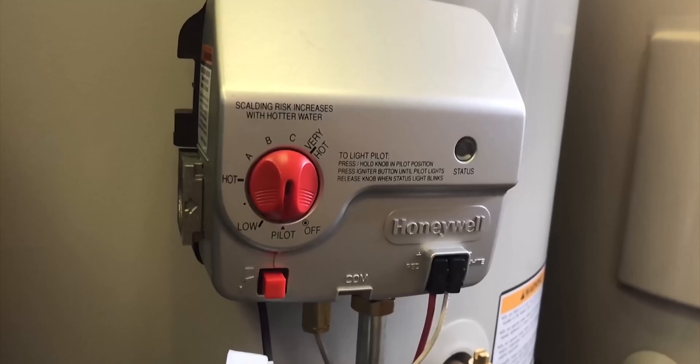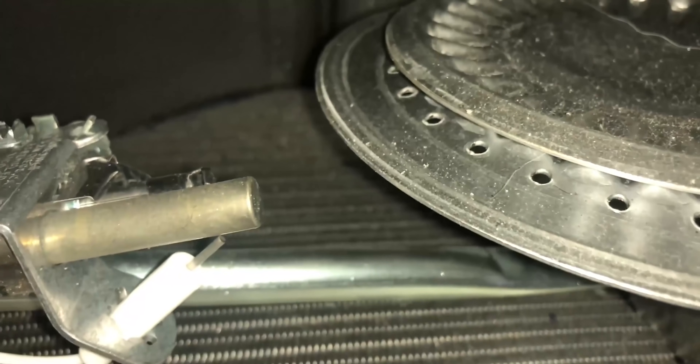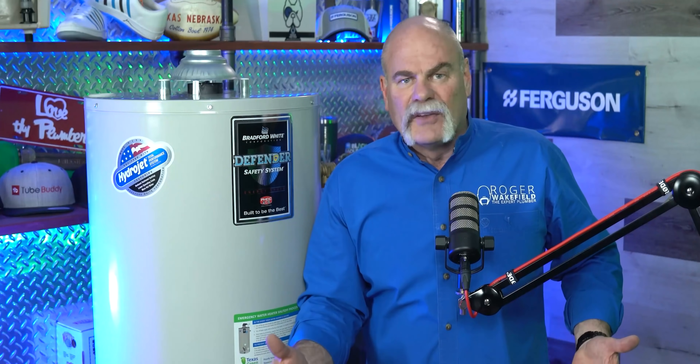Down at the bottom, you've got the control valve and the burner assembly. The control valve has a thermostat that goes inside the water heater to detect temperature and tell it when to kick on and release gas to fire the burner assembly. It also has a thermocouple going down to the burner assembly that stays hot when the pilot light is on, to confirm it's safe to send gas. Water heaters have been modified to be one of the safest pieces of equipment you can have at your house now.